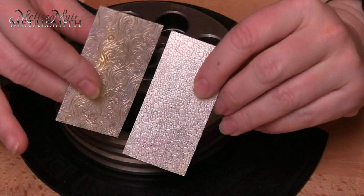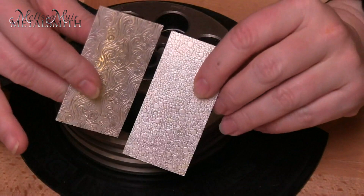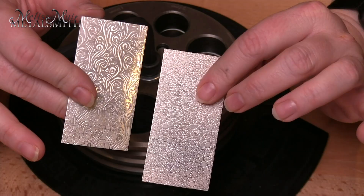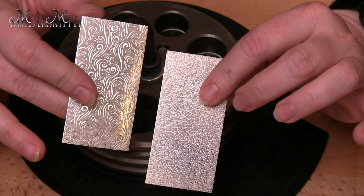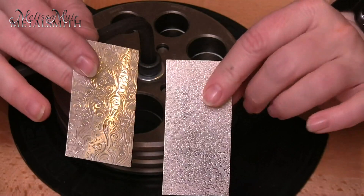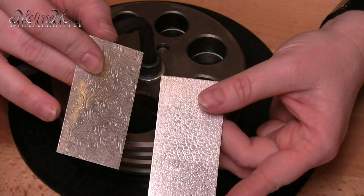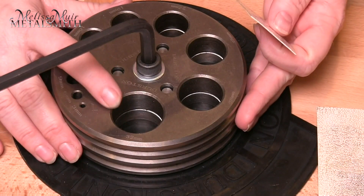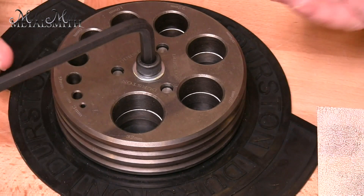For this, I have already rolled out two pieces of 20 gauge metal, which is about 0.8 millimeters. In this case, I'm using sterling silver. I have already annealed this and rolled it through with some pattern plates — in this case, two pattern plates done up by Roberta Peel. You can find her stuff at Oregon Trail Silver; she's got some wonderful textures. I did not anneal these again after rolling through the mill, and that's kind of desirable when going into a punch. I'm using a Durston disc cutter and I want to use this largest hole, which is one and a quarter inches.